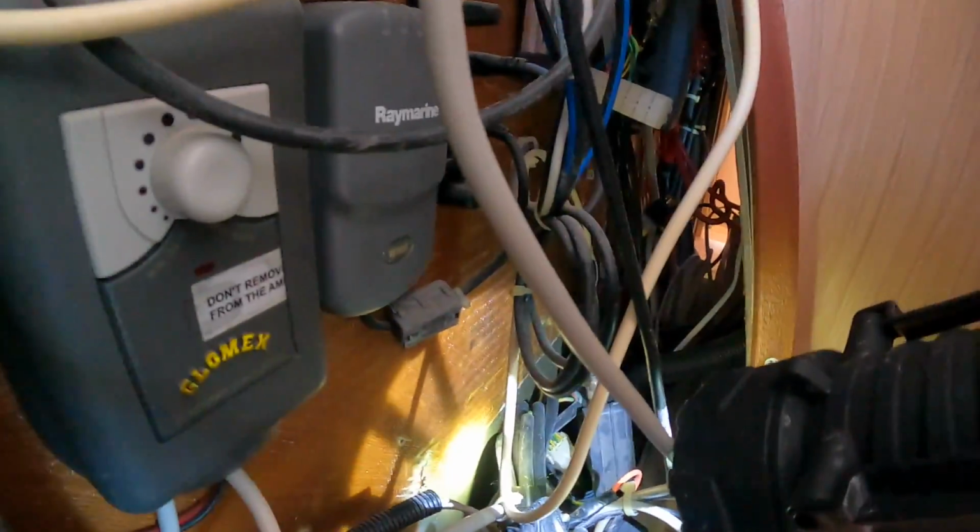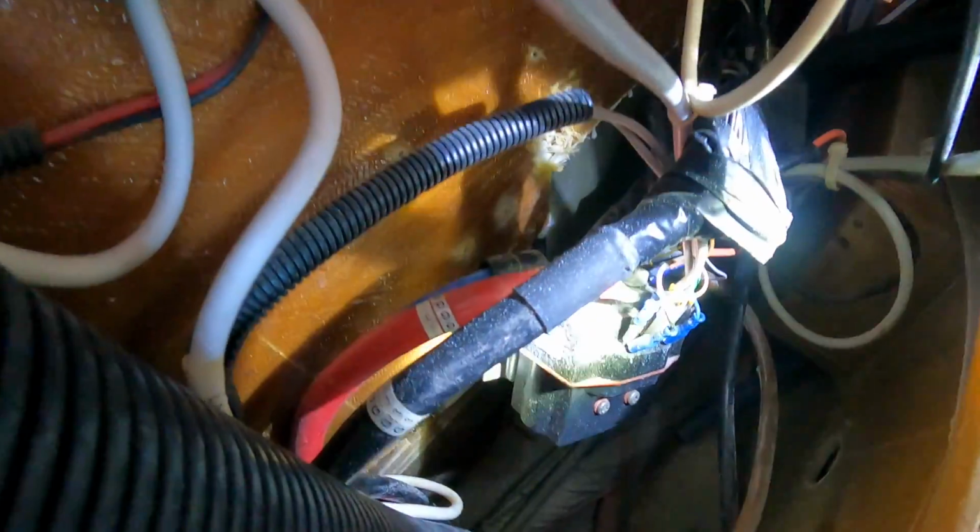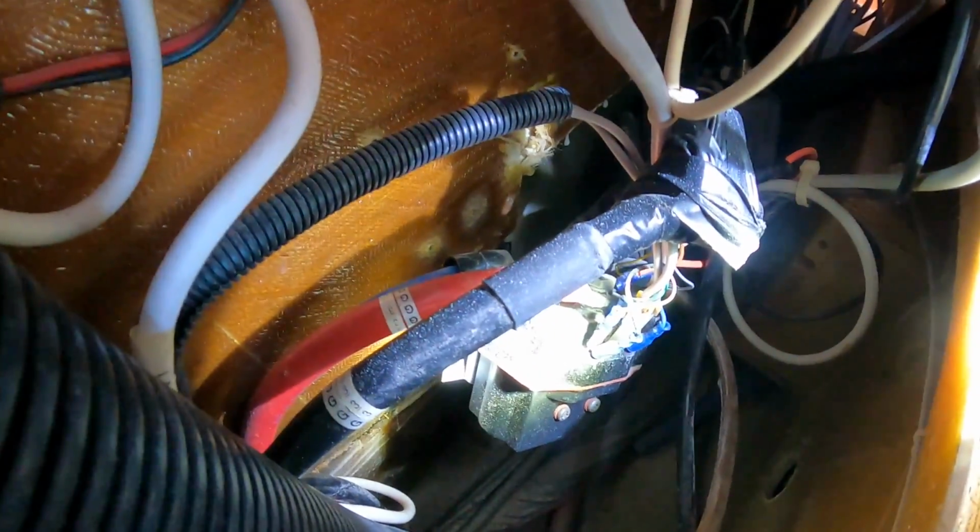Yeah, that's part of the old bulkhead, whereas you see the black is the new. So what we have to do is some sanding, a little bit of thickened epoxy, and then double tabbing all the way across with 1708. Yeah, this is going to be the fun part. It's hard to tell on the camera. That's why it does need to be double-sided.